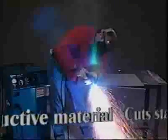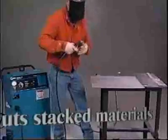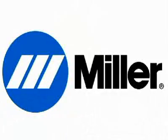Plasma hole piercing is easier. Again, because preheat is not required. Plasma cuts stainless and aluminum. In fact, any electrically conductive material. Plasma cuts stacked materials. The Miller Spectrum series of air plasma cutting systems includes a system that may well provide the solution to most of your metal cutting requirements.